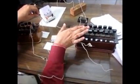For the half deflection connection, first connect the positive terminal of the galvanometer to one end of the resistance box. Then connect the negative terminal of the galvanometer to the positive terminal of the battery. Connect the second end of the battery to the one-way key, and the second end of the key to the remaining end of the resistance box. These are the series connections, in which the galvanometer behaves as a voltmeter.